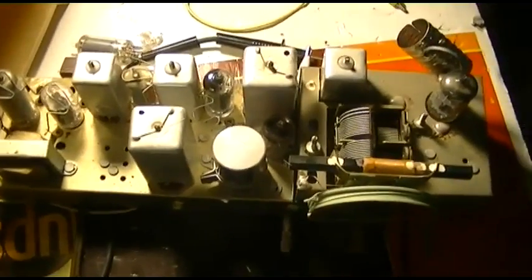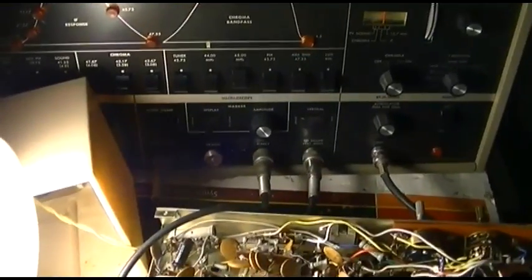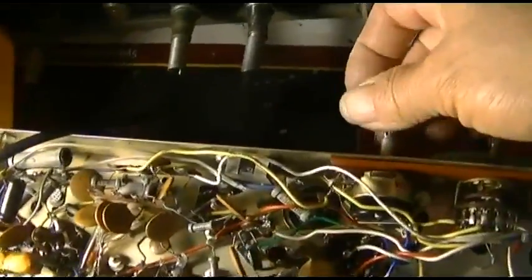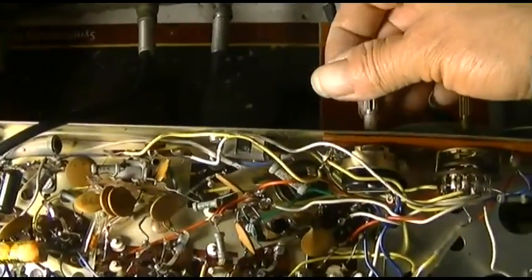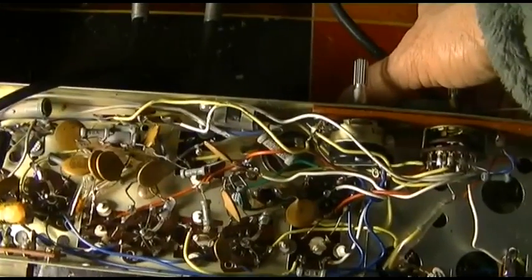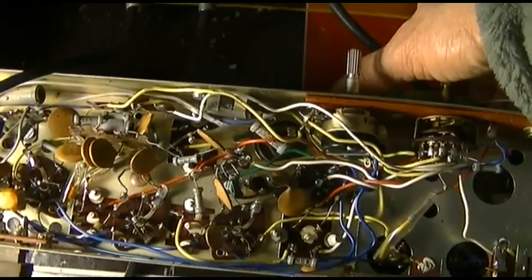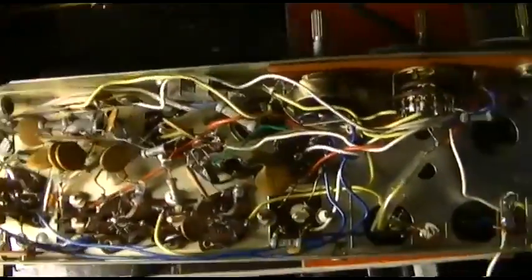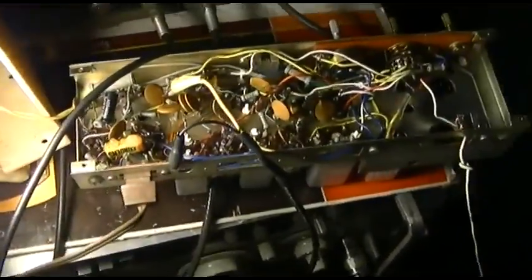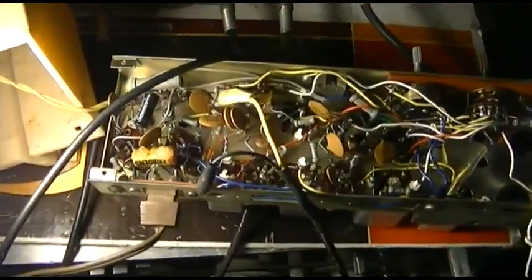Maybe this is what it sounds like when the IF is like 500 or 600 kilohertz wide. Still got a double, starting to sound better, but I got a double hump here. I'm going to sweep it here. And I don't have the schematics, so I'm just going off the instructions for a GE. They're all the same. So I clipped the stabilizing capacitor out of there, which is bad because it didn't do anything.